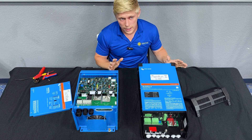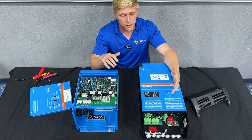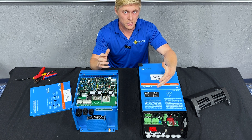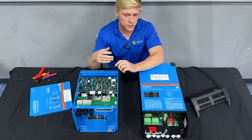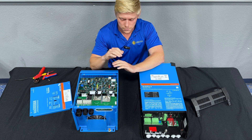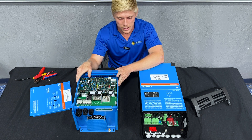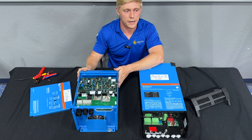There's one more layout we didn't discuss: using your inverter to power only a small portion of the loads within the RV — like a sub panel backing up two or three circuits, or maybe just one circuit. In that case, the MultiPlus would be fine, because if you're only backing up a couple of circuits, you can do that all on a 120 volt connection.